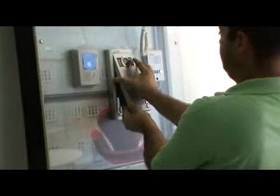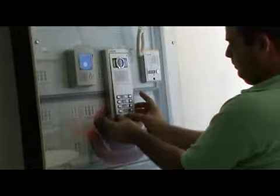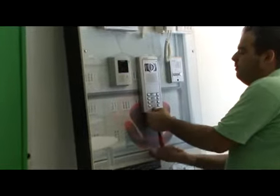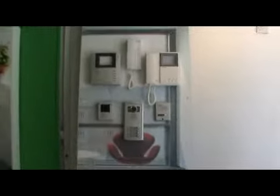Connect the connector on the right-hand side of the back panel. After you put the panel in place, tighten the panel with the screws provided in the box, and the installation of the external lobby phone camera is ready.